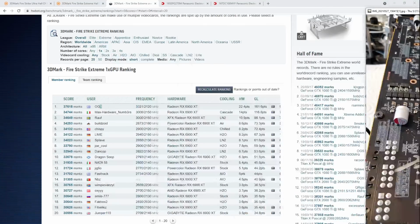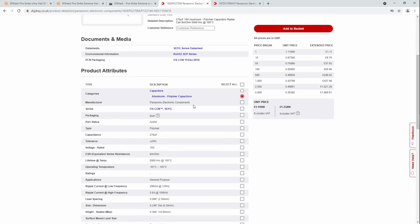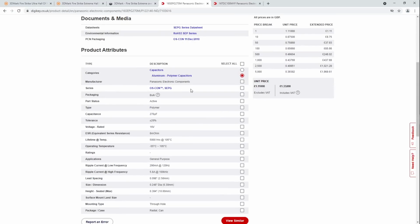And unfortunately, high voltage capacitors, and when I say high voltage, I mean like 16 volts, because it's an ATX power supply that outputs 12 volts. Everything that goes into a VRM is high voltage, instead of the output of the VRM, which is low voltage. Technically, I do know there are boost converters, but anyway, for input filtering, the input power for a GPU is 12 volts. You need to use 16 volt capacitors, because if they made 14s, which they don't, you could use 14s, but you can't, so 16 volt capacitors.